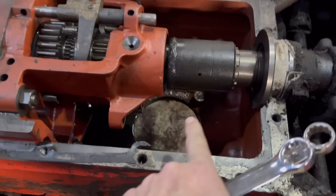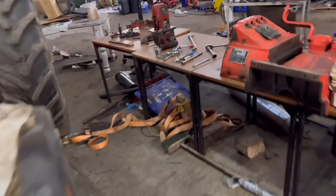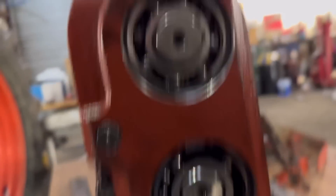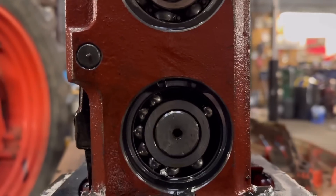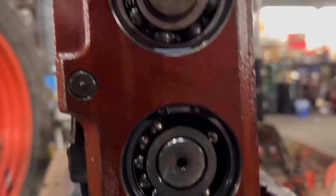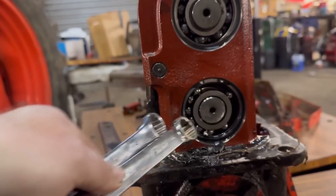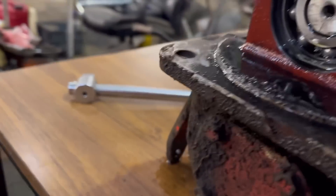While I've been off on my travels, Rob has dropped the transfer box out of the gearbox on the 1690 — that's what basically sends power to the front wheels because it's a four-wheel drive model. Got it on the bench here and it's that bottom bearing. You see it should look like the top one — we've got about eight ball bearings in it. Well, that one's still got all of them but can you see how they're not equally spaced like the top one? They've all fallen around to the bottom, so that's causing it to make a funny noise and not work properly. The other bearing is okay, so that one needs fixing.